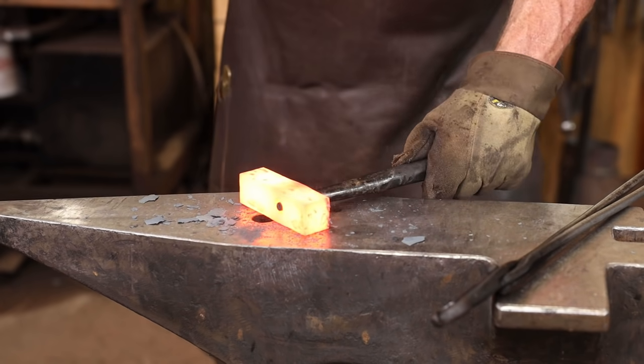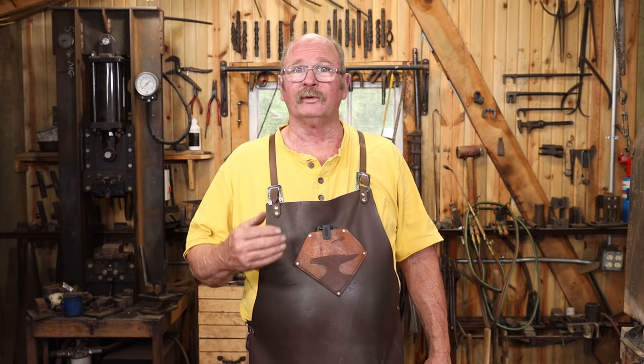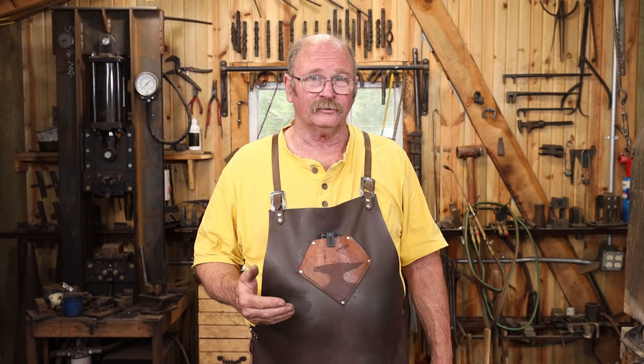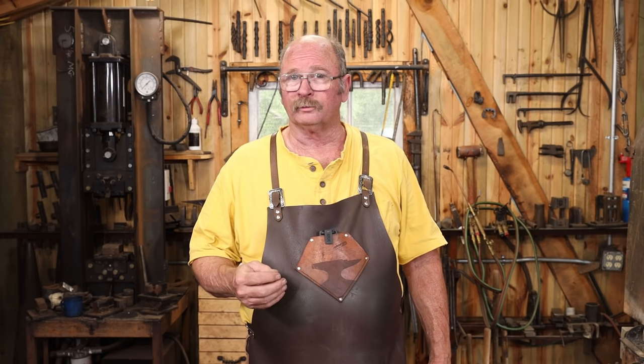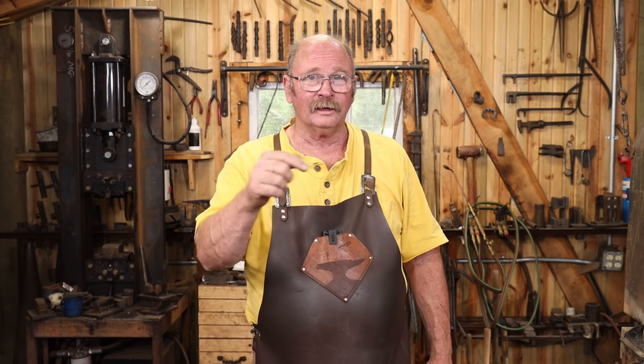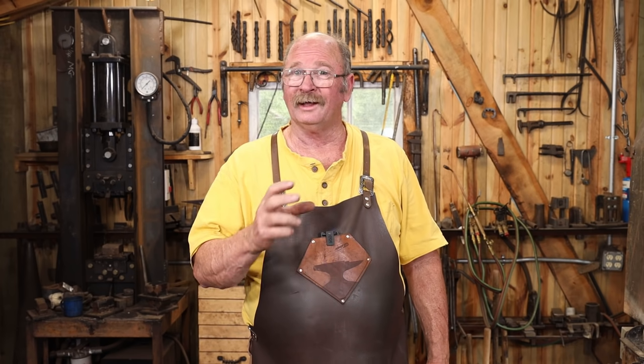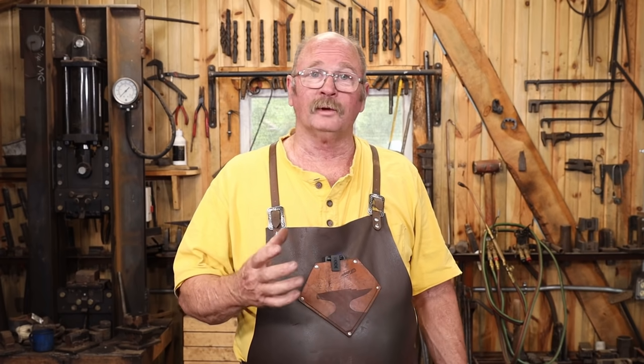There are lots of different ways to create an eye for something like a hammer or an axe or an adze or any other tool that needs an eye, and we've looked at quite a few of those in past videos. I think one of the most precise methods is actually to drill a little hole on either end of where you want the eye in and then punch out the material in between. That helps guide your punch and also makes punching the hole just a little bit easier because there's less material